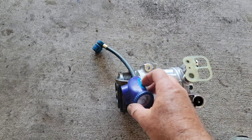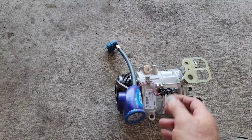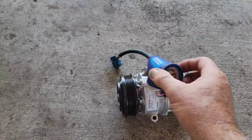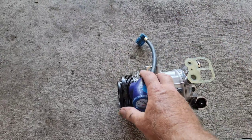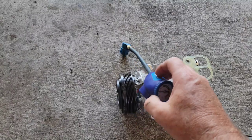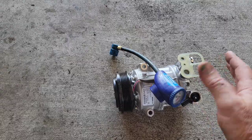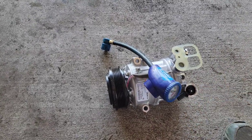The low side has a switch that tells the computer to turn the fans on, so it's a little more complicated than a regular system. These are 1.4 liter high-efficiency engines — they're trying to get great gas mileage, so there are a lot of little efficiency features, and this is one of them. There are a couple of options you can do.